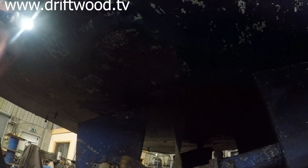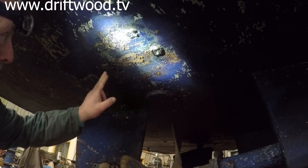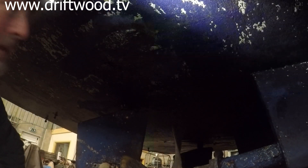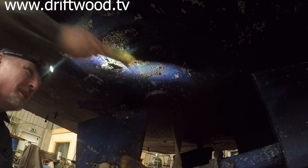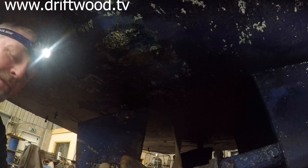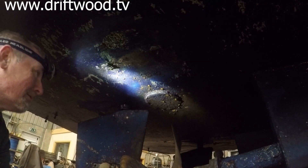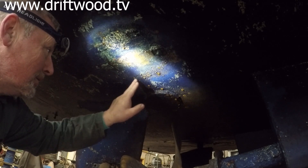Now thankfully there are very few spots where there is rust — you can see little specks of it here. There was an anode welded on there at one stage and another one welded on here. So it's really just a matter of getting in with the wire brush, scraping those parts down, and I'm going to treat them with stuff called Vactan. I'll tell you more about that later — it's great gear for treating rust.